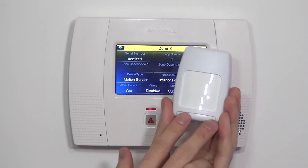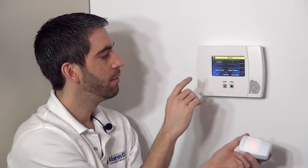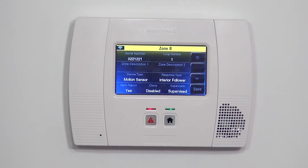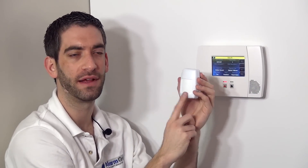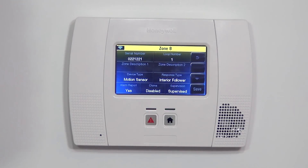Therefore, we're not setting off false alarms as we walk throughout our house in stay mode. When armed to away mode, the sensor is live and active. Because we're out of the house, if there's motion at that time, we want to know there's an alarm. The follower aspect versus interior with delay: with delay will always have a delay — when activated, you'll have 30 seconds to get to the keypad and turn it off before the alarm sounds. With follower, it will be an instant alarm as soon as there's motion, unless we are going through a delay zone first.